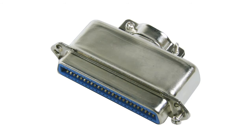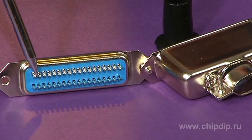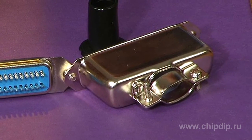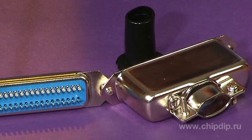CNC 50F Syntronic 50 is a cable socket with housing. Number of contacts is 50, with a straight form of contacts. Mounting manner is soldering on cable. The housing is made of steel covered with nickel. The insulation is made of glass-reinforced thermoplastic. The contacts are made of phosphor bronze with gold plate spraying.